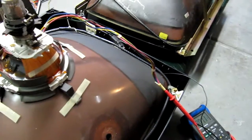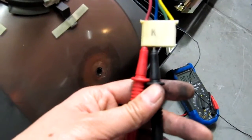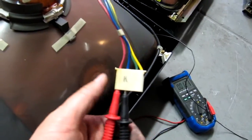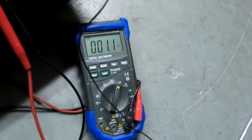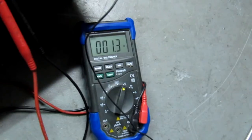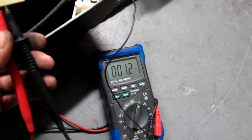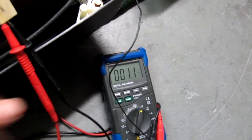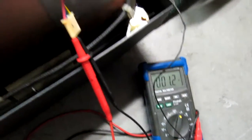I took my multimeter and shoved the red and black leads in — first you test red and blue, then green and yellow — just testing the resistance between them. For these Sharp monitors, I've been getting about 1.3 on one reading and 8-and-change on the other. If you're getting similar readings, you're basically in the same pocket. This is my third monitor and I've seen similar readings for all three, so I've concluded they're all probably going to be in a similar range.